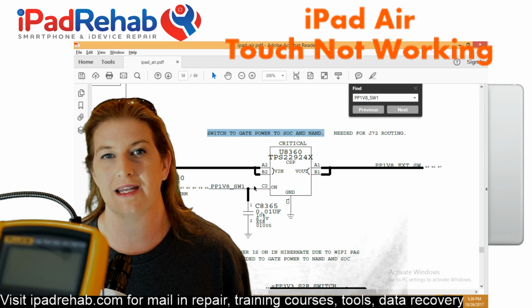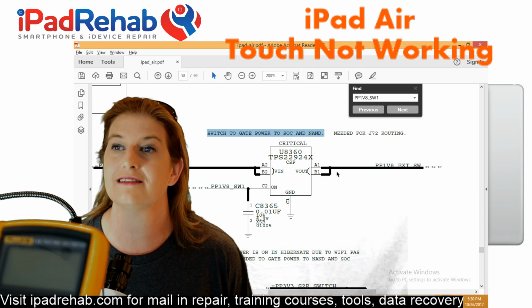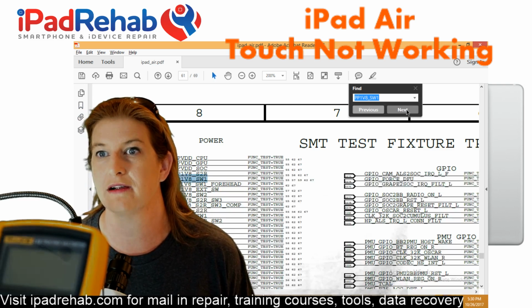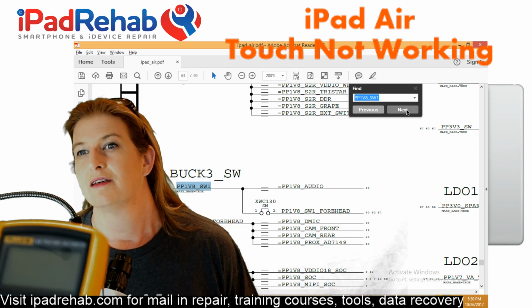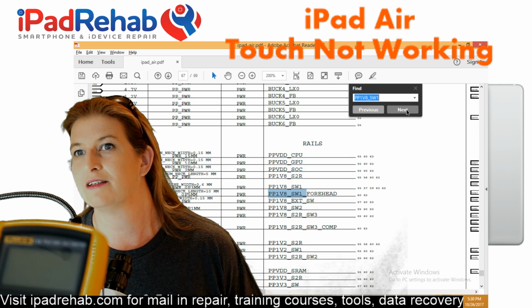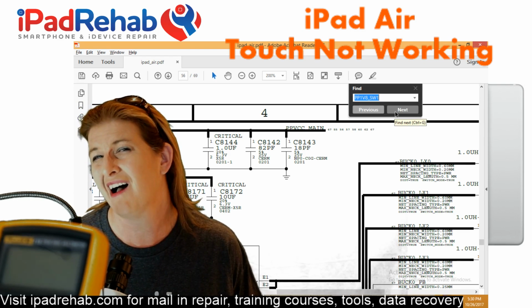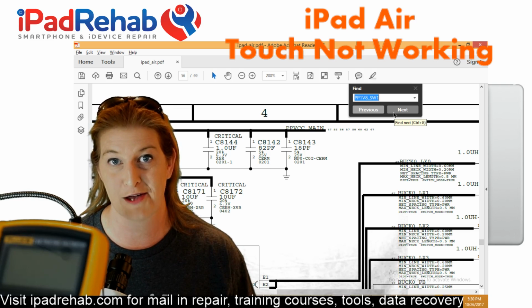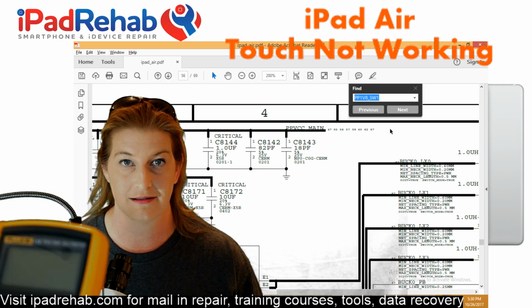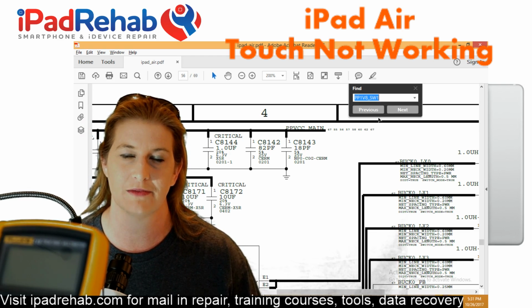All right, so PP1V8SW1, not our line, not relevant to touch power, is the signal that turns on this chip, and this chip, I happen to know from last week, is relevant for NAND power. Where else does it go? No stuff, no care. PP1V8SW1 looks like it turns into some audio line. So SW1 is not really relevant for our problem because we know it must be present. How do we know that? If I measured 1V8SW1 at C8136, it would be there, because this thing turns on. So we know it has NAND power, and this chip ultimately generates NAND power. So we're going to say it's present.